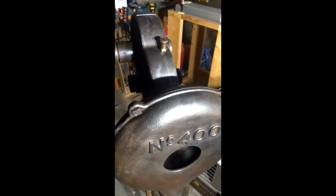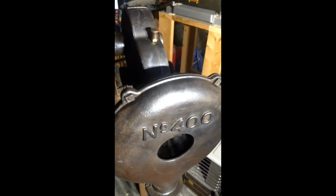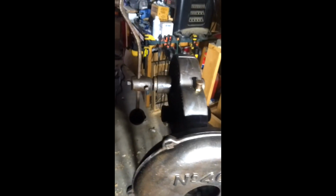I've got it adjusted where it makes the least amount of noise and the gears aren't slipping like they were, so that's good. I've got quite a little bit of coast on my handle. I didn't really have a whole heck of a lot of that before. It's got a lot of 30 weight non-detergent in it, with a little bit of Lucas oil additive, give it a little bit of slickum. Now if it'll just warm up, we'll stick it back on the forge and light it up.